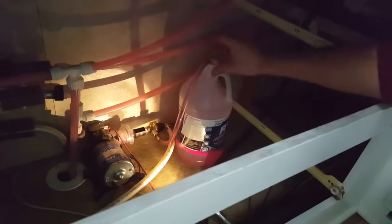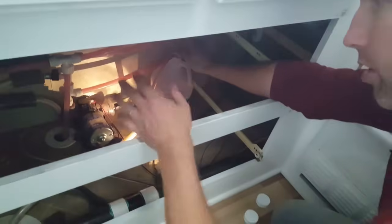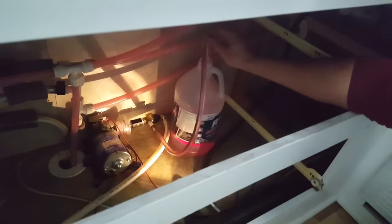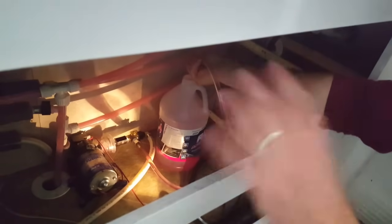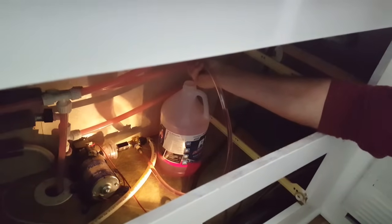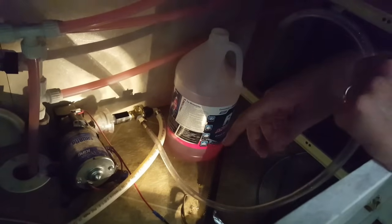We're done with the antifreeze but it's still hooked up and we still have a full line of antifreeze in there, so we want to remove it without making a complete mess. The pump is still on, so when there's a draw it'll run. We're going to pull up the hose, get to the end of the line, and put a finger over the end of it. Jenny is going to turn the faucet on to put a draw on it, and as soon as that gets sucked out we'll turn the pump off. Got it - now we can unhook the hose without antifreeze going everywhere.